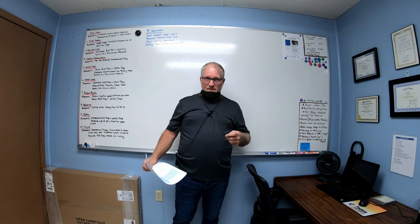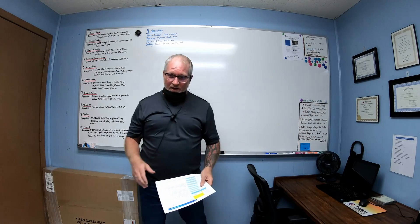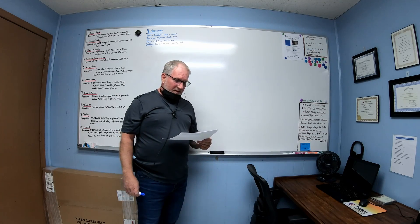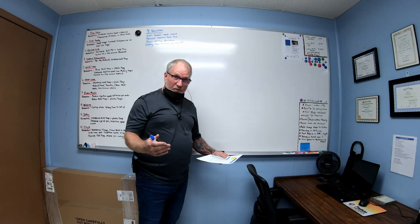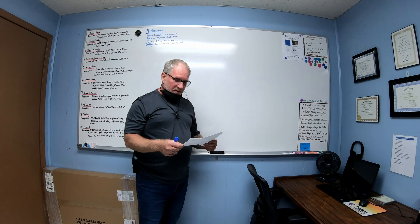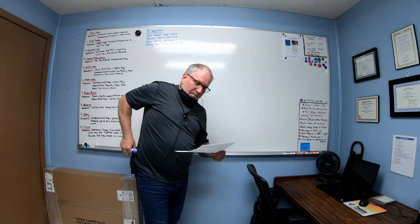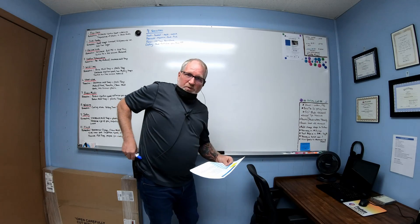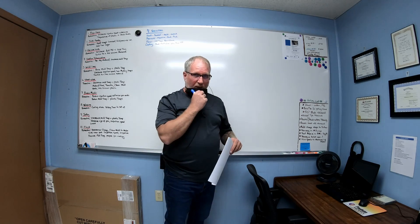Welcome back YouTube, this is Dave with Injection Molding Skills and More. Today I want to go over a gate freeze study. The purpose of this test is to determine the point at which the gate begins to freeze off, and pack and hold pressure can be removed. This is to ensure that the process is optimized and that there's no time wasted pressurizing an already frozen gate. This will show you what your hold time or pack time is actually supposed to be, so you have the optimized process cycle.